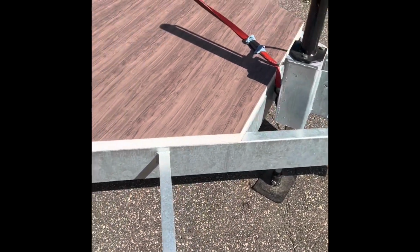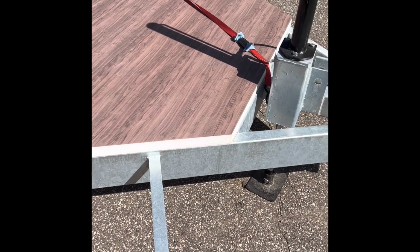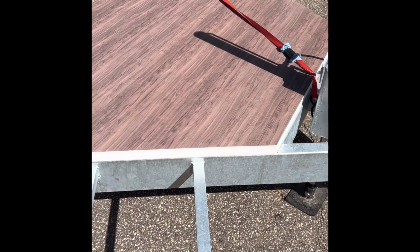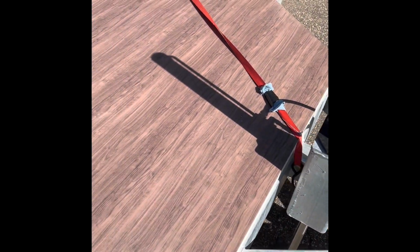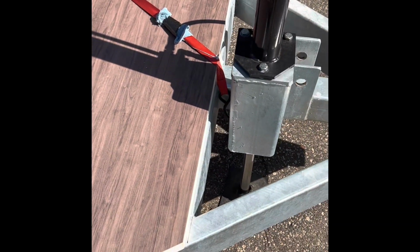And then this is also a stub nose frame. I kind of designed the front end myself. Had Miltona Blacksmith make it to my specifications. The normal V front is a 45-degree angle typically, which on an 8-foot frame is 48 inches, right? So from the edge of this panel to the front is actually 48 inches, but I widened this out to have a 3-foot stub nose on the front.